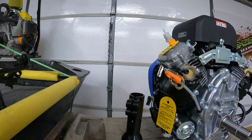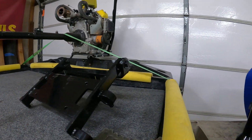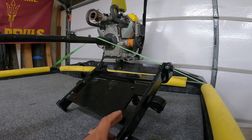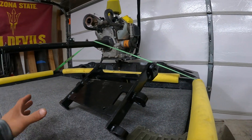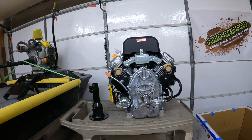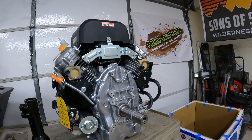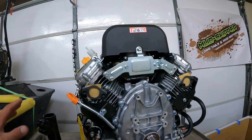Alongside the 20 horsepower mounting kits, the Duramax 999 has about a nine-inch bolt pattern — it does have four inches front to back but a wider bolt pattern — so we'd still have to modify this. That seems like an easy setup, but I always feel the shaft output is going to be the weakest link if it's not balanced right or if it can't handle the torque — that's what would worry me the most.